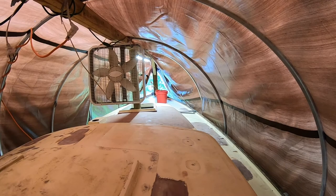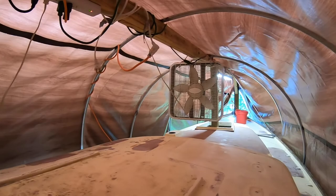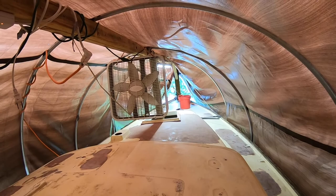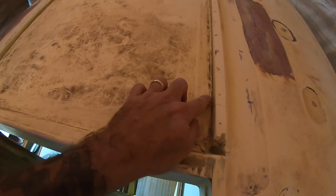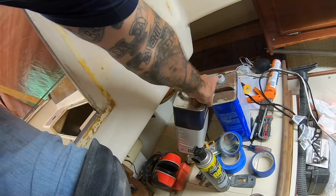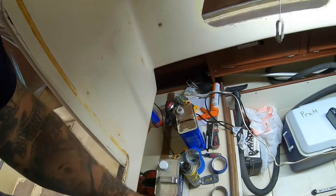We're at the stage of the deck paint. Got everything off the deck. I had to install these posts inside, got another one coming up through the front hatch. The fan's hanging but it's off so you can hear me. Bucket's up there. I'm about to wash the whole deck - scrub and wash, it's just dirty, gotta get all that crap off. Then after that dries I'll come back through with surface prep de-waxer solvent wash, that'll get whatever else off, and then I'll do the prime coat.